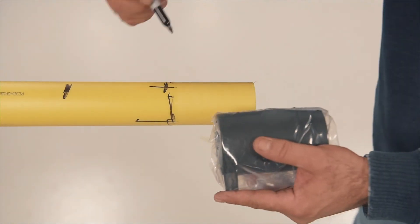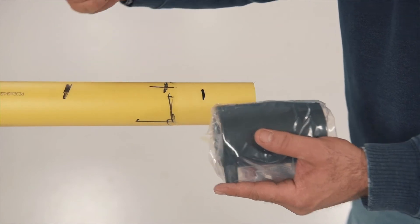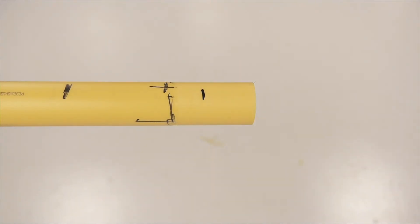The final step is the operator marking the finished stab depth of the coupling. The other side of the joint is a duplicate. Having the final stab depth marked assures that the coupling is in proper position before the fusion process begins.